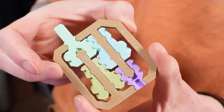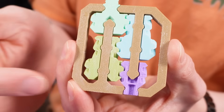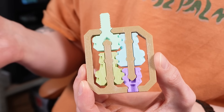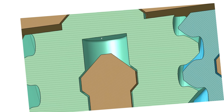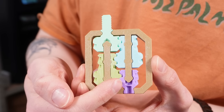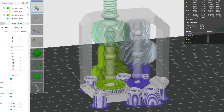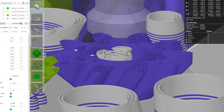To finish off, I want to talk about the design principles of print-in-place or self-contained mechanisms. Each gear is suspended in place by a bulge on the axle, which I can print by using 45-degree overhangs and underhangs. The only awkward part is that the input and output need to breach the housing, so the axle stops short and the gear itself has the same kind of bulge feature to hold it inside the housing. On the top side we can terminate the shaft and bore with a 45-degree cone so no supports are needed, but on the opposite side we want the axle to start in mid-air and connect to the housing at the top, so some internal support is needed. I left a small shelf on the bottom of the pin and a floor on the bottom of the housing, so a tiny support would generate and then easily break off once the gears are turning.